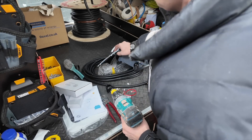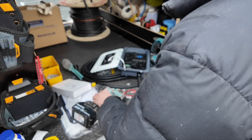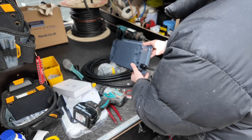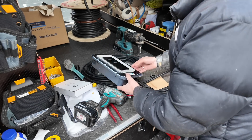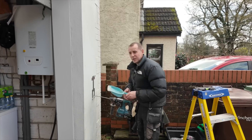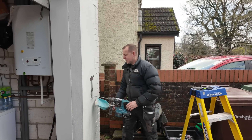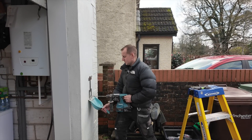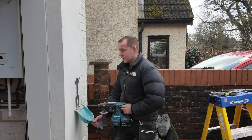I'm hoping I'm going to have enough room within this charger for my 25mm gland. Don't let me down Indra. And when you're drilling this, don't be a donut and leave it on hammer - just take it off and you won't blow the brickwork. It takes a bit longer but it's worth it.